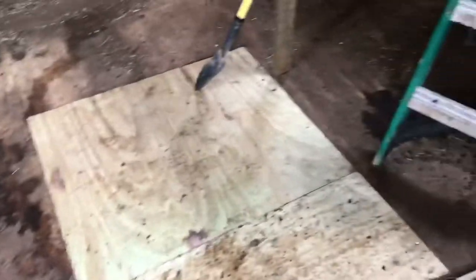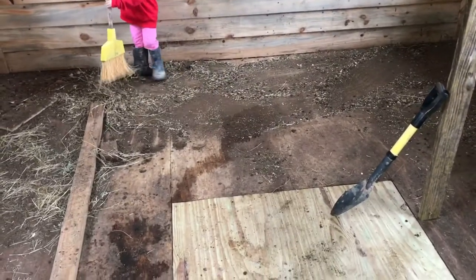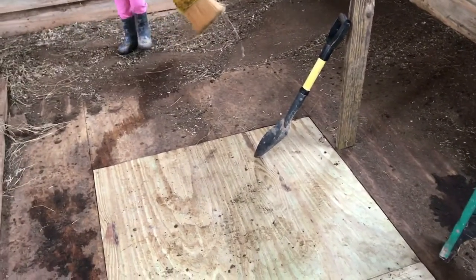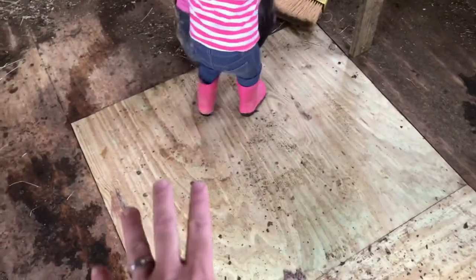Finally got the goat barn floor done. You can see the difference - the pieces that are stained and dirtied and peed on are the ones I originally put down in a hurry, hoping to build the first pens back there and patch later. We ended up not needing those pens due to the tragic goat loss we had. Figured I'd better get in here and get it finished. Had to go back to the store for two more sheets of plywood - ended up using one and a half so I bought two. Got it all patched up: the original section, then one under the door which was really hard to cut because nothing was square - ended up with a little extra groove I don't love, but it is what it is. Then I cut and scribed the last one to fit and dropped it in as a key.